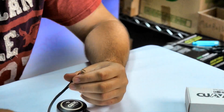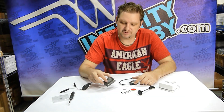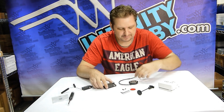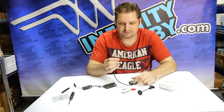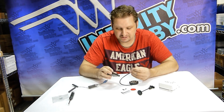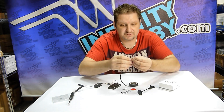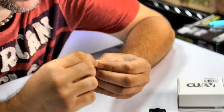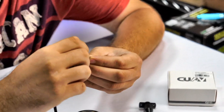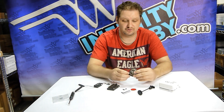As you can see here, it's using the DF-13 connectors. Now some of your flight controllers are using the Molex plug, but this unit uses DF-13s. If you've got this compatibility issue, it's still compatible and will still work — the plug is going to have just a little clip on the edge, and you just have to take a knife or a file and file that away, and then insert it. It should work very well.